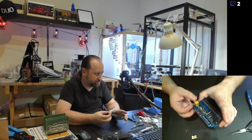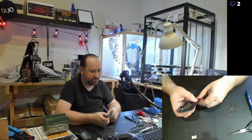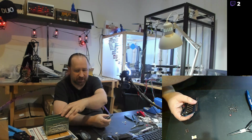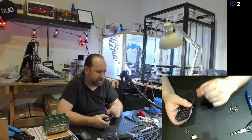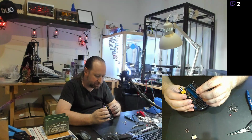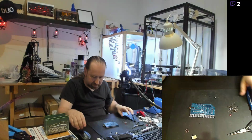They made them 39 pin because the boards fit a certain form factor for these smaller boards. And that's cool if you're going to buy one of the pre-made RC2014 kits. But as I built one myself, I actually picked these really nice large green cards. They're super cheap on Amazon. You can get a whole box of them. I think I have maybe a dozen of them. I got them for like 10 or 15 bucks. They're all a pretty nice big fat form factor. I will continue using those. But of course these smaller boards totally fit in on this as well, because it is using the same bus as the actual pre-made kits.